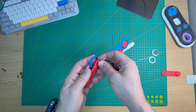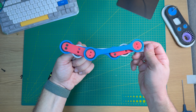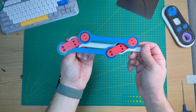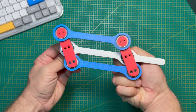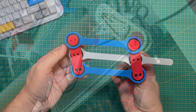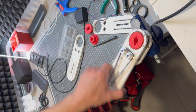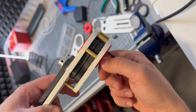If we add a second rod on the opposite side, the whole mechanism locks up. Plastic parts and small backlash make this effect even worse. Only when both shafts rotate in sync can it overcome this singularity. So I tried adding a timing belt to synchronize the camshafts. It helped a little, but that's not a simple gearbox anymore.